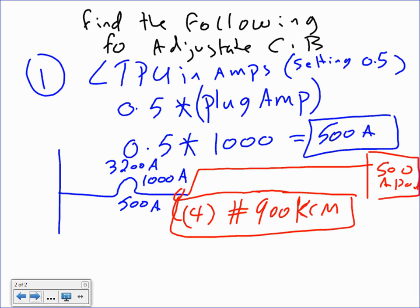Good point. But as I said, it defeats the purpose, because the reason why we're tweaking is because we don't want to pull cables. Imagine the amount of money that you save by not sizing based on 3200. With future expansion though, your conduits are ready to go. Whenever you expand, you just pull new cables. With the switchgear, guys, literally, it will take you probably 2 hours on a weekend, shut down the switchgear and go pull new cables. The conduits are there, tie them from both ends. Within 2 hours on a weekend, you have turned a 500 amp into a 3200 amp. If that wasn't designed this way, you have to custom design, screw up the whole switchgear. It will take you at least a week, plus the whole mess with fitting new equipment. It's a mess, and more expensive too.